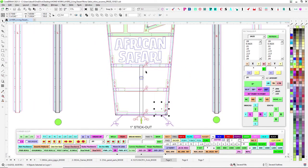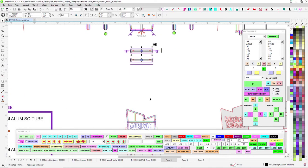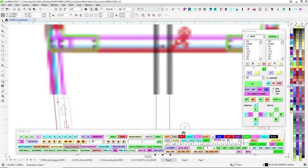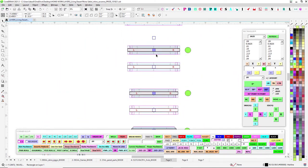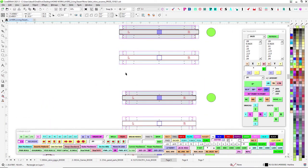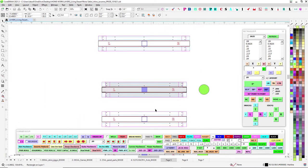Get all that tacked together. The way I see this: you're going to slide that two by two through first - here's your cutout - you're going to slide that through and leave about a one-inch stick out. It's not super important, just as long as it's past this a little bit so you can get in there and tack it. Your main cross pieces have clearance for that bar to go through. Keep your rights to the right and your lefts to the left because the angles and the holes - you can see where this hole is not perfectly centered - again because it's not symmetrical.